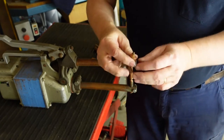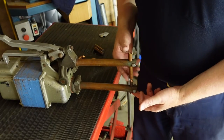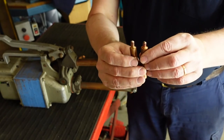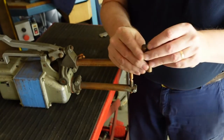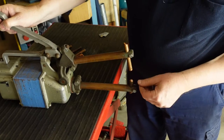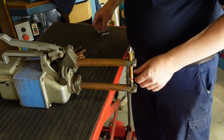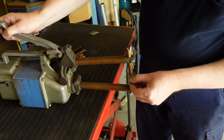I have various electrodes that I've made up. There are these cranked ones — the idea was to be able to put a spot right up against a corner. This setup with a long top one and a short bottom one was for getting into a box. There are a couple here with reduced sections to get into another tight spot, and then these ones with a flat top, which I'll get to in a moment.